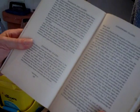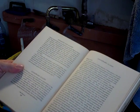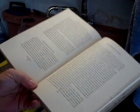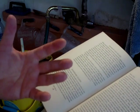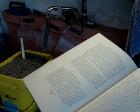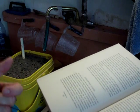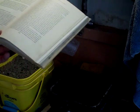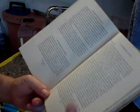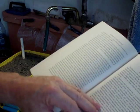Potters originally stumbled across it probably because what they noticed was that in the kiln — they put the pots into the kiln with no glaze on the outside — and after the firing, there were certain parts of the pots that had this kind of glaze appearing on one side, where the flames had passed by and left a deposit of fly ash. Fly ash is the wood ash carried from the firebox throughout the whole kiln. This fly ash deposits itself on the pots. So they began to realize that the wood ash was making a glaze on its own. Wood ash is very easily accessible.